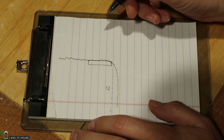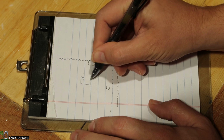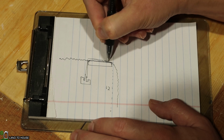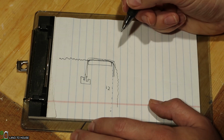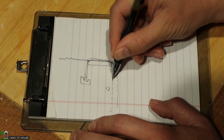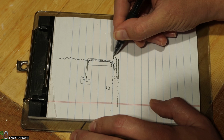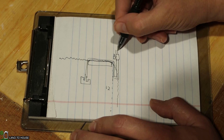So the plan is to take a pipe, and with the intake, which is kind of like an upside down T, kind of comes up here. It's going to make a 90 around the waterfall, like this. And then it's going to come down a couple of feet, maybe like 3 feet or so. And then I want to take a little T out from here and go up, back up here again, and have a ball valve. You know what a ball valve looks like. There we go. With a little pipe up here.